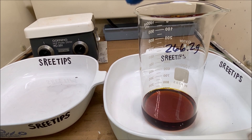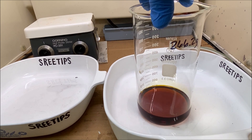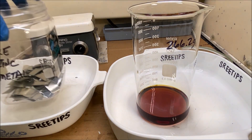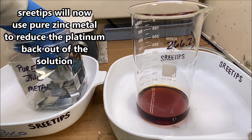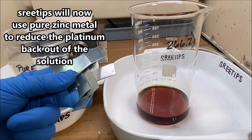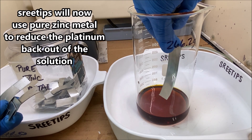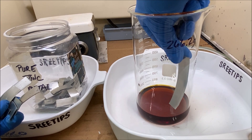In part three, we dissolved the black powders — some of it didn't dissolve and we removed it in the filter. So now the weight of the metal in here has changed and what I need to do is reduce it back into the metal. I'm going to use some pieces of pure zinc here, just drop them in. What this will do is enable us to calculate the exact weight of the metal we have left in this solution so that we can go to the next step.